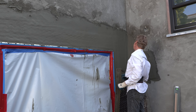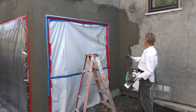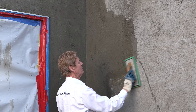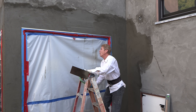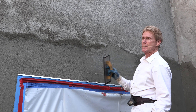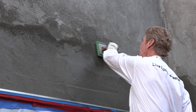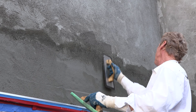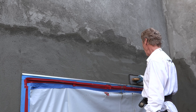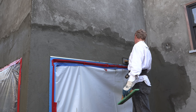That section can set for about 15 minutes, then I'll use a hard rubber float. Here's where we're at: I put a little water on the sponge and floated this. When you're bringing new mud into existing material, do the patty-cake treatment for the mechanical bond — get it wet. We had a whole mixer full of mud and applied it; we finished the entire back and the front just now. Now that it's on we can relax a little and exhale — we were sweating.